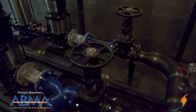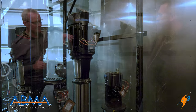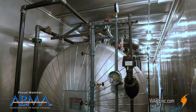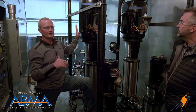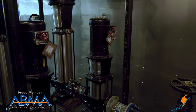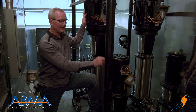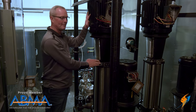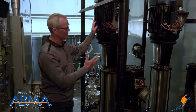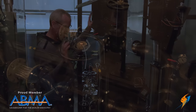Coming out of the DA and into the pump system, we always design for a backup — a primary pump and a secondary that comes online if something fails, so the system is always feeding the boiler. The challenge is we can't get the DA tank elevated enough to provide adequate head pressure for the pump, which caused a lot of pump failures over the years. Our solution is a booster pump: a high-volume, low-pressure pump set to produce 20 PSI, so the main feed pump always sees sufficient inlet pressure. The full assembly includes block valves, strainers, and check valves.